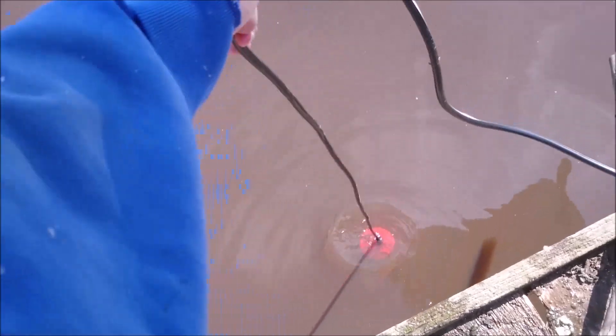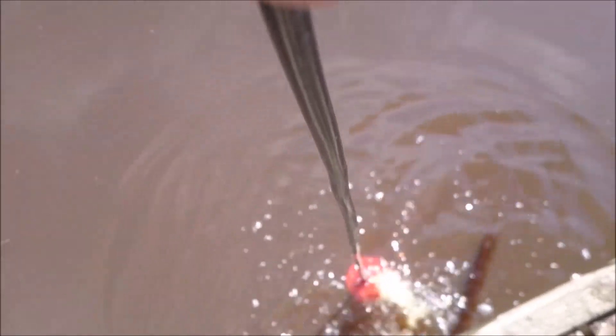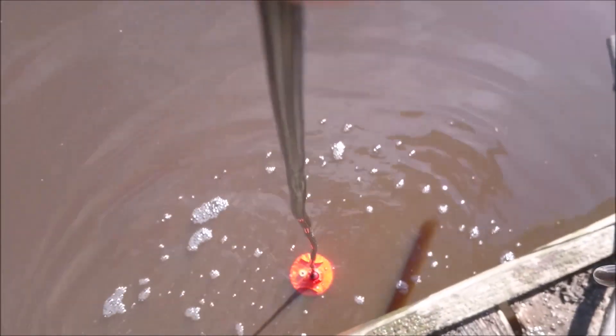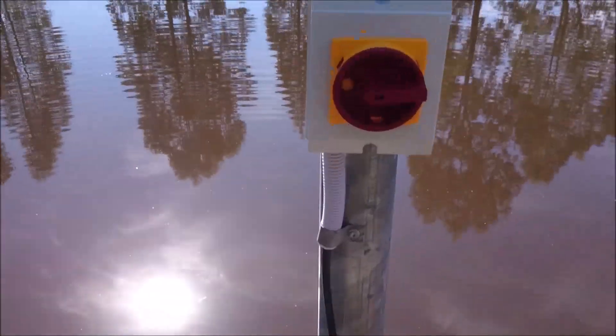Let's test out the pump — it's a beautiful sunny day today. I'll be suspending the pump using floats so that it is not resting on the floor of the dam. It's working fantastic! This keeps the pump from resting on the bottom of the dam and picking up mud. That's the isolator there.